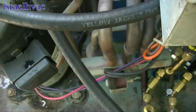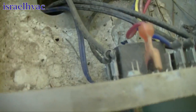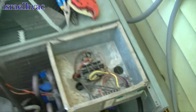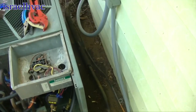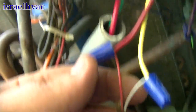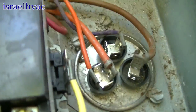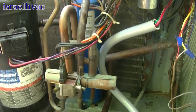Because Ruud and Rheem energize in the heating mode and we're using this as straight cool, that'll kick the contactor in and automatically put it into cooling mode. I'm going to take the condenser fan motor off the defrost board and hook it straight to the contactor, because we do not need the defrost board to break the fan motor — this unit will not be defrosting since it won't run in heat mode. Alright guys, you can see the red and yellow are hooked up. Red's going here, yellow is right here. That should pull the contactor in and put us into cooling mode.